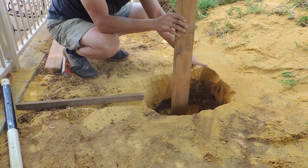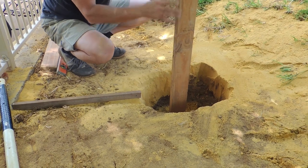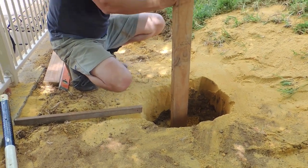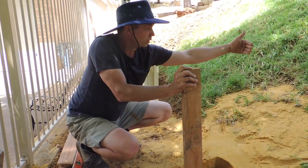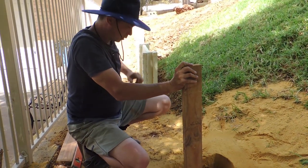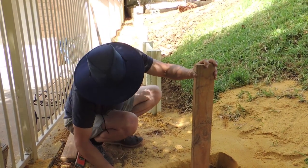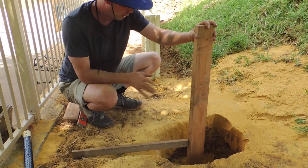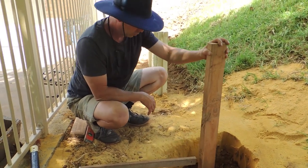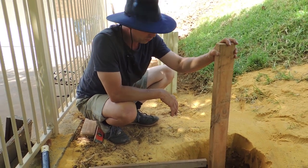You'll find you've got less chance of movement. Because this soil goes rock hard, we don't really need to worry about it in this case. We're going to anchor two bags of cement and anchor it more to the back. This isn't really retaining a lot of weight — it's just a bit of garden bed and we've got a second wall to go behind that. I just need to dig that a little bit deeper by another inch, and then we'll show you how to drop it in. Once that's done, you're home and hosed — that's all you need to know, you can do it yourself.